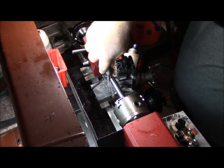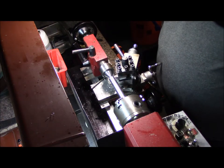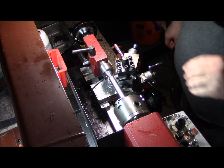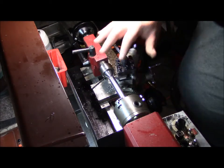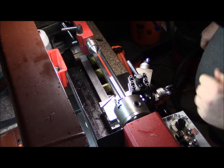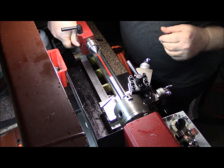I think what I'm going to do is go ahead and drill that quarter-inch hole. I'm not at my finished diameter yet — I'm at 0.650 right now, so I have another 25 thousandths to go. If I induce any wobble into this round shaft, I can still mill that out as I finish up. Let me go ahead and change chucks here.